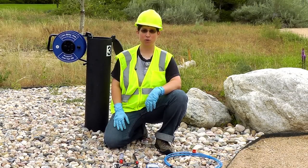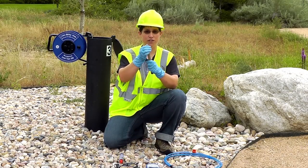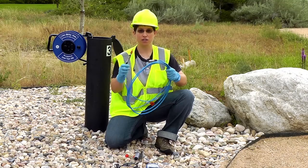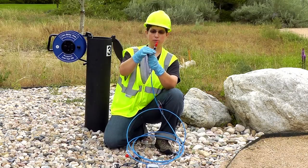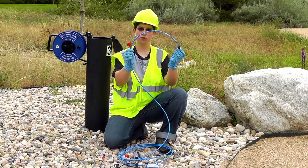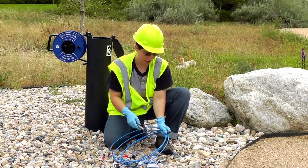Next, we're going to connect up the equipment. First, we're going to remove all the red dust caps. There may be a small desiccant on the Rugged Twist Lock cable. To remove this, twist the metal fitting and pull straight out. Note which end the service grip is on — this will be the up-hole end. We will connect the Level Troll to the other end.